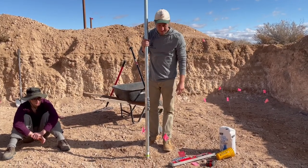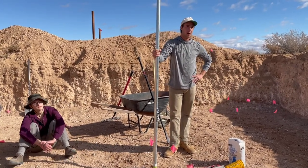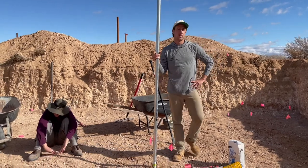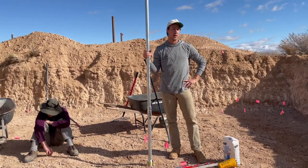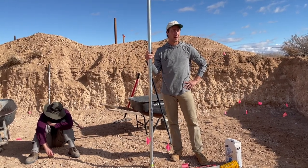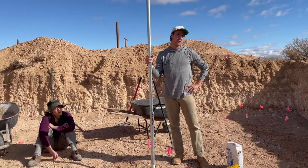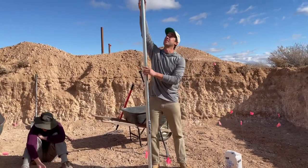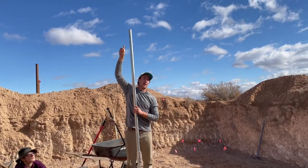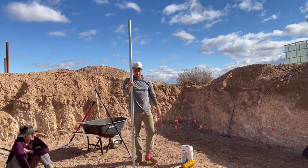What's the amount of height you need on a pole for a large dome like this? We have our 15-foot main diameter dome on a one-foot spring line, so ideally you'd like the pole to be about 10 feet tall. This is an eight-foot pole, which will be fine — we'll just need to put a fastener on top as we get to that elevation so it can't pop off. It's going to be totally fine.